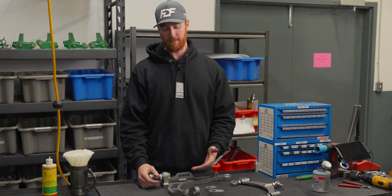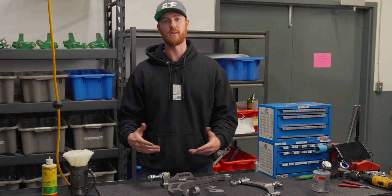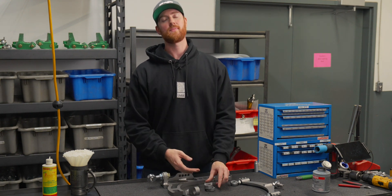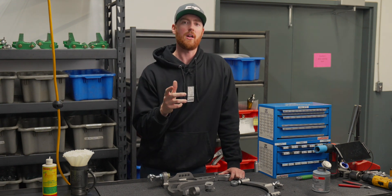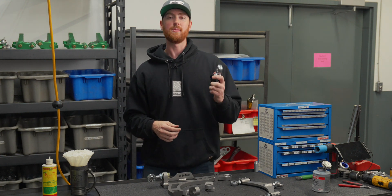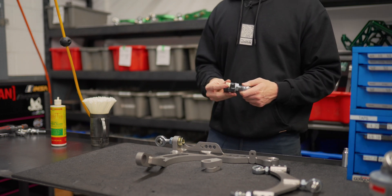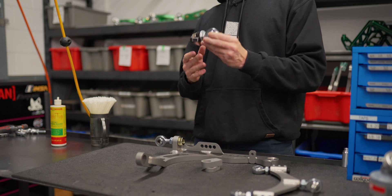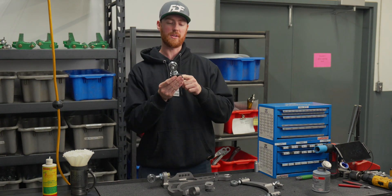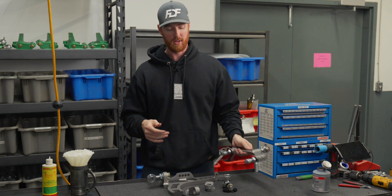The design concept isn't new — to adjust something where it's not engaging with the control arm, able to spin freely, that is not a new concept. But the way we've been able to bring it into our manufacturing process and use it on so many different applications — especially the smooth adjuster on the lollipop adjustment for BMWs — is new. We made a smooth adjuster application that applies to a chassis and can be used on any kit, doesn't matter if it's ours or not, and gives everyone the ability to on-car adjust their caster with the BMW kits. That's the E46 lollipop — bolts to the chassis — and the adjustment range is actually no different from a threaded bung. The improvements are always necessary to continue to improve.